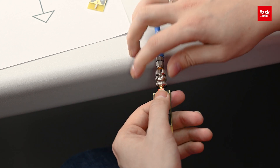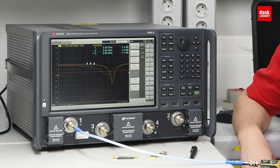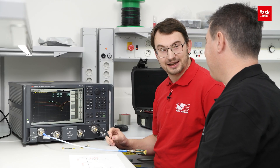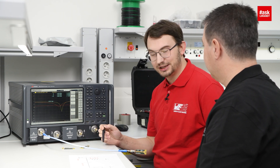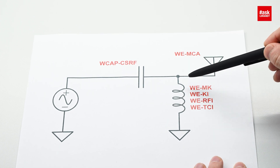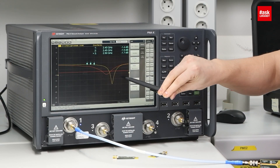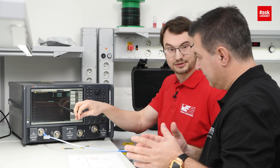Let's put my prepared board with the capacitor. Okay, I would say this is very good but not for Wi-Fi. Yes, you're right — it's very nice for this frequency range but not for ours. As you can see, a matching circuit is not only one component; normally we use two of them or even three. In our case, using only a capacitor gives matching for a different frequency range, but we need to go to our frequency range.